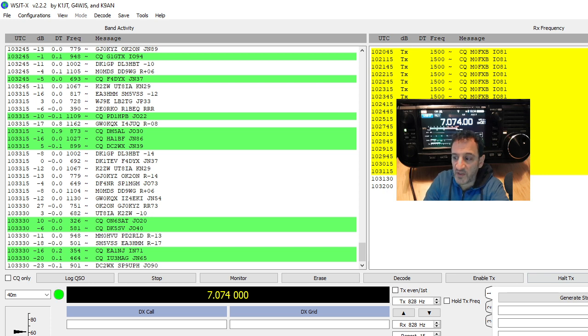Let's see if I still get an error. Going to hit Tune first. We didn't get an error this time and the ALC looks like it's back — you normally want just about one little blue line. It is reducing though but we are in TX. It's gone to nothing, and I think it's because I need to earth my antenna properly. The SWR seems okay and the power is at 5 watts. Let's turn the tune off, enable TX, and see if it fires back up.